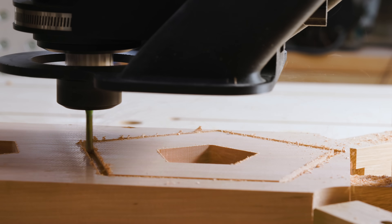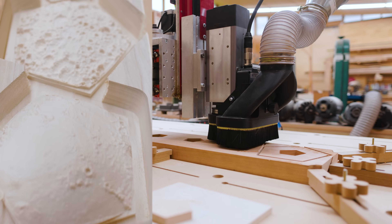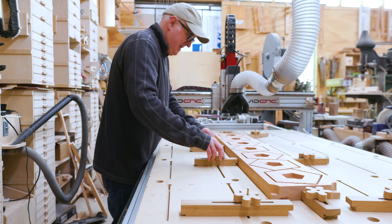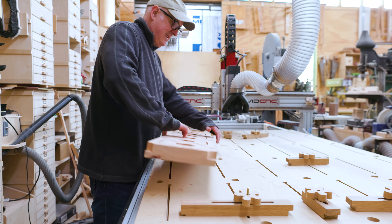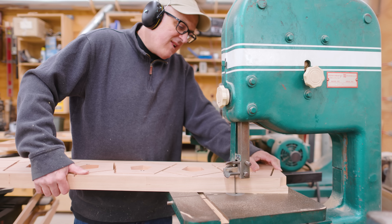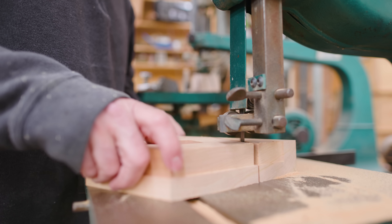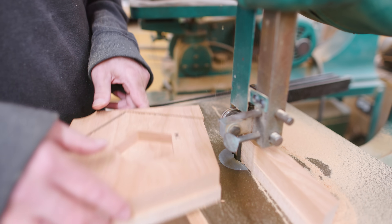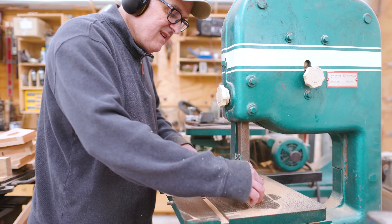This is a little bit different from the way I did the moon. With the moon project, I cut all of the surfaces into each pentagon before I separated them from the bigger piece of wood. The dust collection boot is even getting the chips out of the cut, which is really nice. I labeled the pentagons at this point — they don't really matter now, but they will in the end. Then I can cut each of the pentagons free. It's a little easier to not cut them all the way through with the CNC, and I don't have a quarter-inch bit that will cut the entire two inches of depth of the cherry.